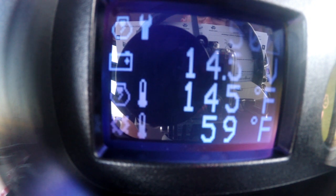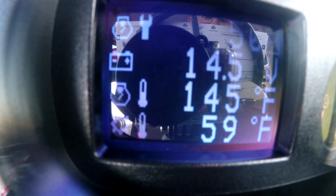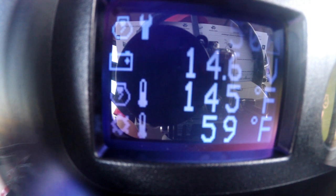This is basically a diagnostic screen. The first screen is going to tell you your next service interval — you can see a 50-hour service interval is the next trigger. After completion you can reset this and it will go to the next required service interval as a reminder. Below that is the battery voltage, engine temperature, and transmission temperature. The second diagnostic screen is going to show your diesel fuel level and your urea level. If you had pneumatic braking, it would show the braking level here also.